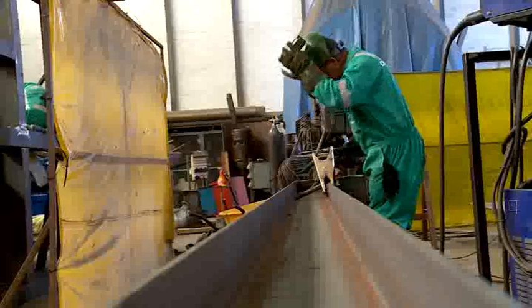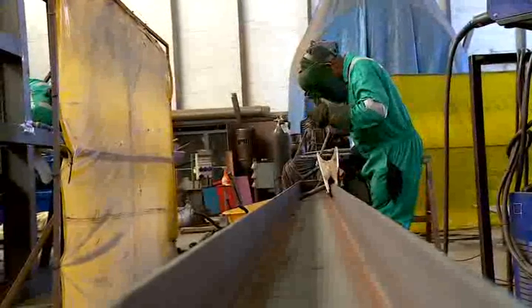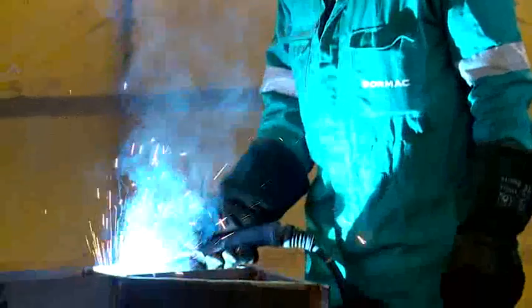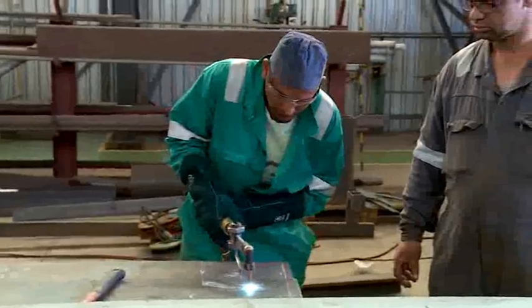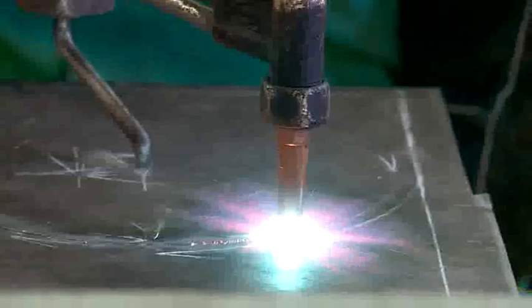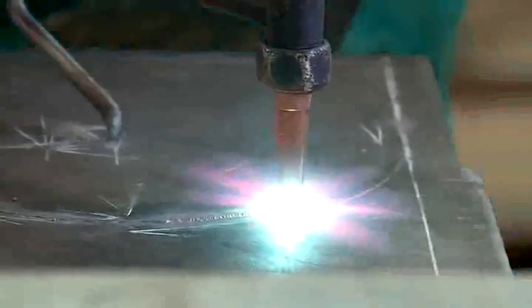The structural plater is doing shell plate work, renewing parts of a ship's steel body. He removes the old welding marks, cuts away the damaged steel part, and then re-welds new steel onto the shell. The rough edges are then smoothed with a grinding machine.